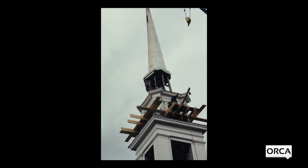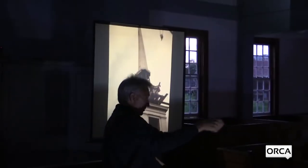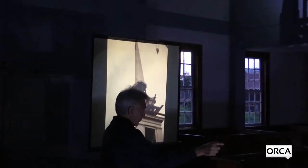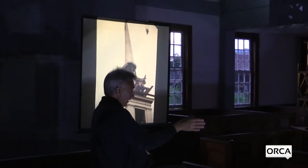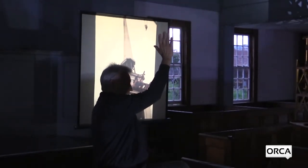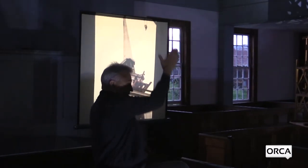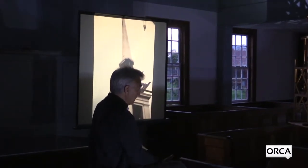This is a technique that was used by Christopher Wren in England. He would frequently hook together a bunch of 30-foot timbers with iron cramps, and at the bottom of them, frame a large floor, and separate the floor 3 inches from the side walls of the building, so that when the steeple was pushed by wind, it had an internal pendulum. The center of gravity was moved inward and downward dramatically.